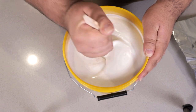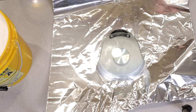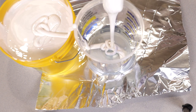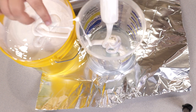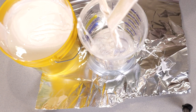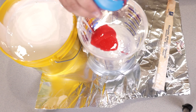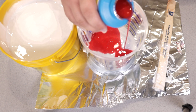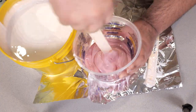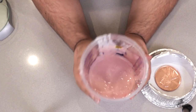Then pre-mix the giant tub of silicone to make sure no oil is separated from the actual silicone. Then grab a scale — link in the description — and measure out 300 grams of silicone. Pouring the silicone into the jar is gonna be a bit overkill, but thankfully the silicone is so thick and viscous, just dip the mixing stick into the silicone and let it drip into the container. Do this until you've got about 300 grams. Then when it comes time to add the catalyst, divide the weight of the silicone by 10 — that's how many grams of catalyst you add, or about 30 grams. Mix until you get a nice uniform color without any streaks. Then tap the container and give as many hard taps against the counter as you can so air bubbles escape.